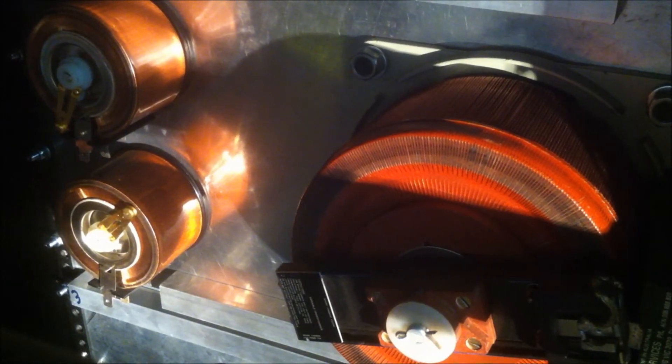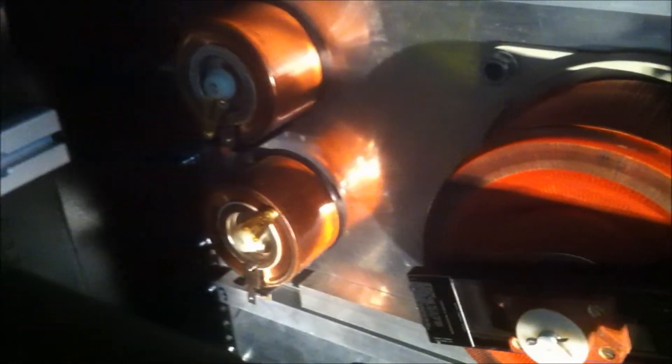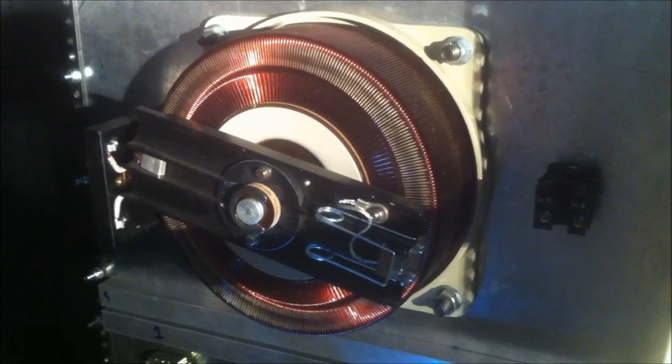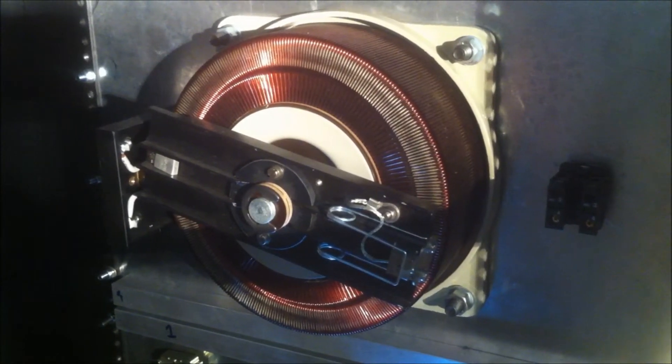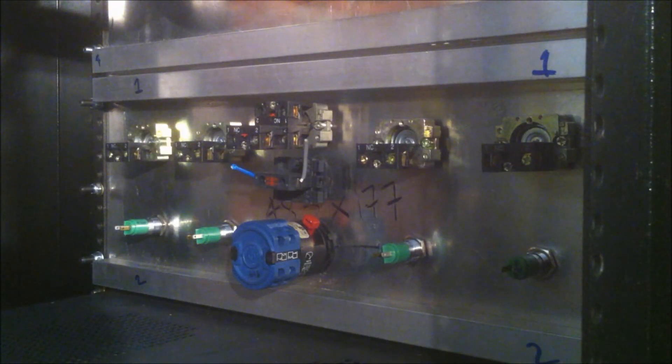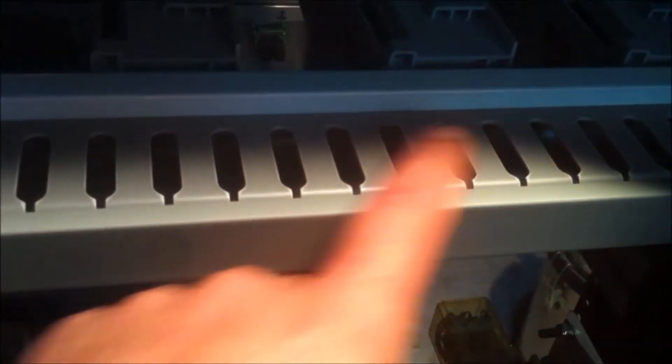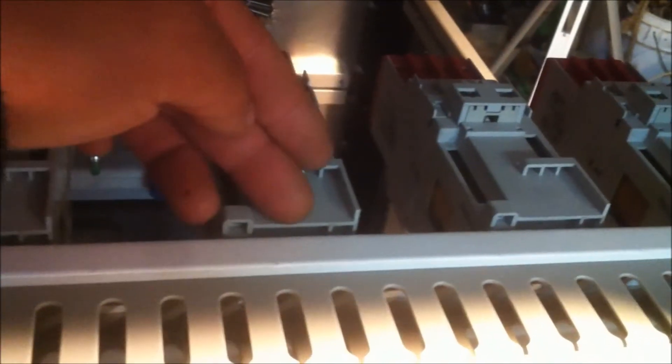Here's a quick look at the variacs on the top panel — you can see the two 750 milliamp variacs and the 8 amp variac. There's a shot of the inside on the 15 amp variac on the next panel, and the back of the emergency stop switch panel. Looking at this thing from the back you can see I've mounted a few steel brackets, and on the back side of those I've mounted some cable tracking, so all of the components mounted on DIN rails on these white brackets can loop their wiring back into this and run up the side of the box, keeping everything neat.